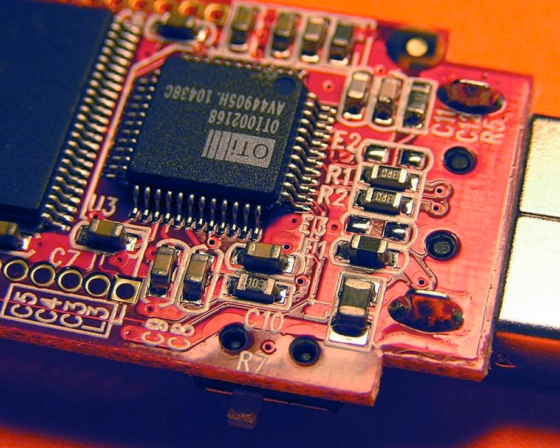Low-profile fine-pitch ball grid array LFBGA, a square or rectangular array of solder balls on one surface, ball spacing typically 0.8 mm. Thin fine-pitch ball grid array TFBGA, a square or rectangular array of solder balls on one surface, ball spacing typically 0.5 mm. Column grid array CGA, a circuit package in which the input and output points are high-temperature solder cylinders or columns arranged in a grid pattern.